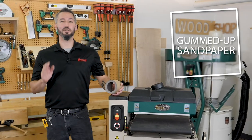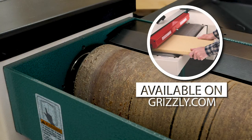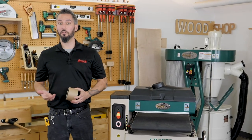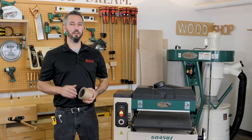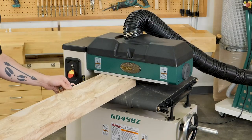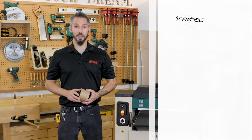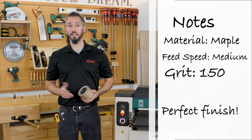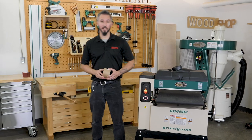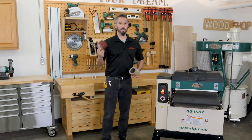Gummed-up sandpaper is another reason for burning, so using a cleaning pad or simply replacing the sanding strip is required. It may seem that a slower feed rate is ideal for the best finish, but with some grits it may actually be the opposite. We recommend using a test piece of material or carefully adjusting between feed speeds to get the best finish possible, and make notes of your feed speeds and material for future reference. We recommend having several grit options on hand near your sander to help cover the needs should the sandpaper strip become worn with use.